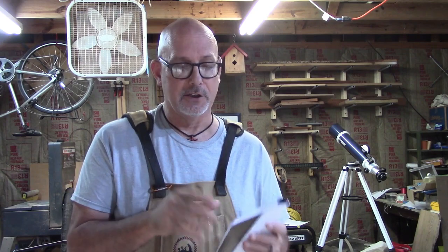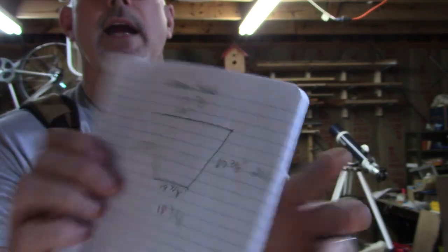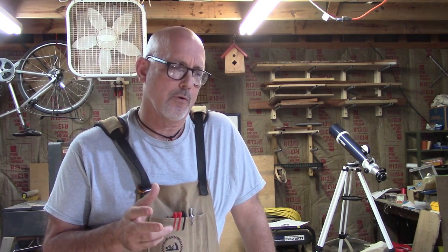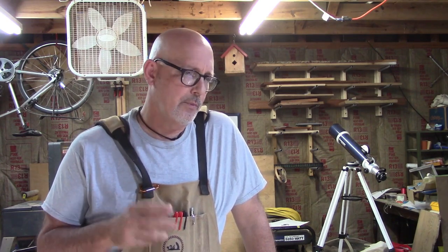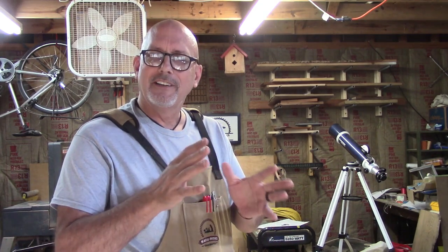The thing I've had the hardest time with is figuring out the angles because I did not have anything with me when I was at the boat doing my measuring. So I've gone online and tried to draw it out. I think this will work — this could be just an utter disaster. But the short version is we're going to make a wedge shape. To get started I want to go over to my miter saw and get the angle set on it for 10.2 degrees, and then we should be able to start cutting. I'll mark them roughly so I know to get the cuts in the right direction, and then we can start putting it together.